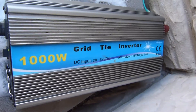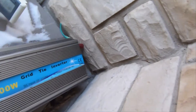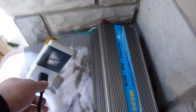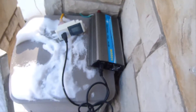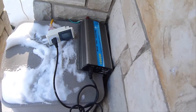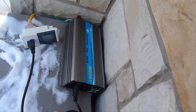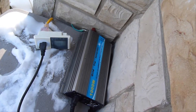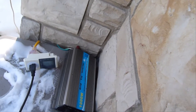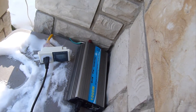Be careful when you buy because even though it says 1000 watts, it all depends on what your inside breaker can take. Right now I'm just making 35 watts. I'd suggest getting maybe smaller inverters and connecting them on different indoor circuits. The breaker I have indoors is 15 amps. If I put too much current through it via the solar panels — I had near 800 watts at the time — it would just blow the circuit, the breaker would trip.